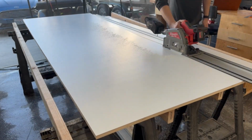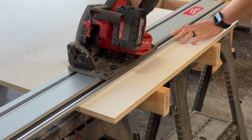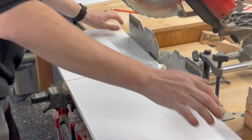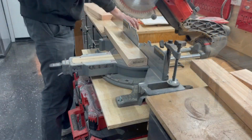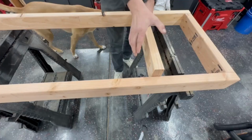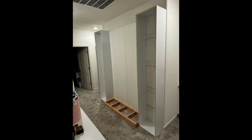The next step was cutting and preparing the cabinets with shelves that are made out of white pre-finished plywood and birch edge tape. The height of our wall is about 108 inches and 94 inches wide. We left 12 inches above each cabinet.